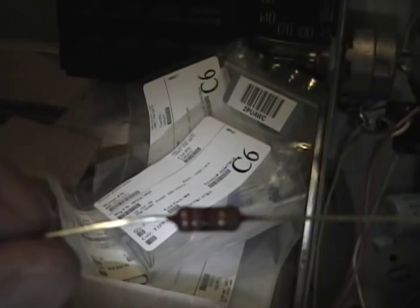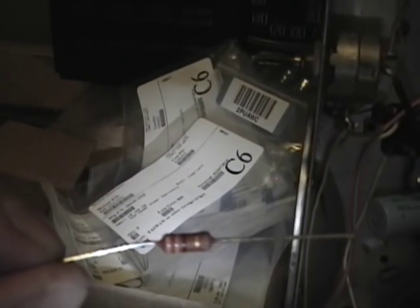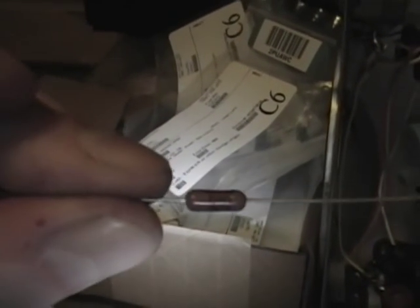You should really look these up online if you're not sure how to read these values. My little explanation here is not going to be sufficient. On other resistors, especially power resistors, they just print it right on there. Like this one is 150 ohms — you can see that — so no guesswork there.